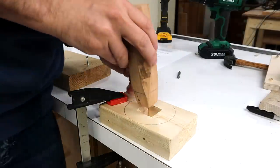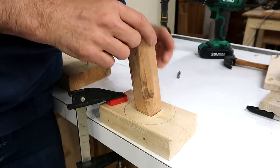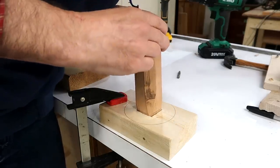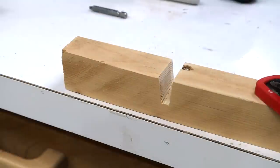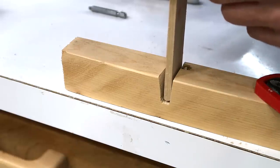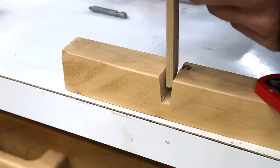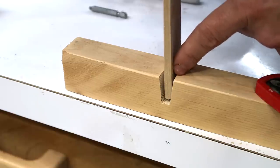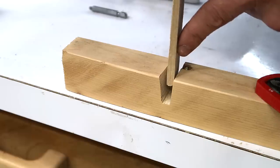Here's my screw and here's the bit. If I'm a little bit off center as I'm driving it, seen from the screw's point of view it's as though I keep going around and around like this. Under steady applied torque, even if I keep pushing down on it, it keeps climbing out. Here's an even simpler model: just a flat stick in a slightly tapered slot. As I apply torque and rock it back and forth, it has a tendency to work its way out because it's always easier to slide where the slot gets wider, and every time it slides, it works its way up.